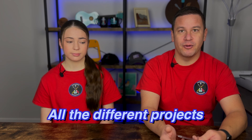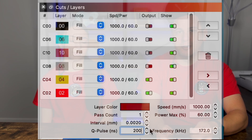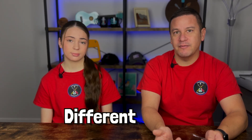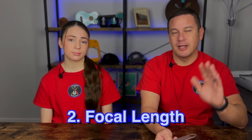It's really neat that you can get a little bit more detail in your projects by inserting color into an engraving — it opens the aperture to all the different projects you can do. We've found that engraving in color is quite simple once you get your settings dialed in, but getting those initial settings definitely requires a materials test. If you're going to use our settings, keep in mind that every machine is different — a 30, 40, or 50 watt system will have different results. It all comes down to those initial settings and how focused the machine is.